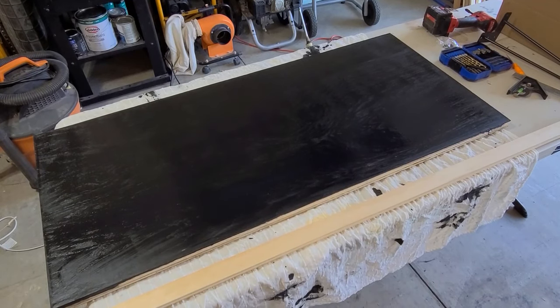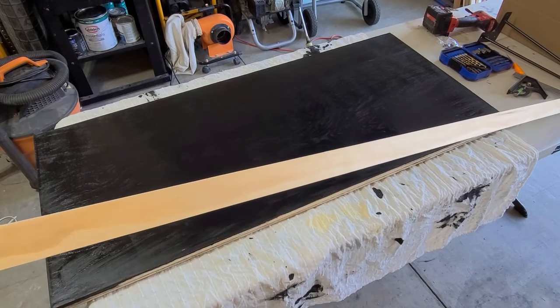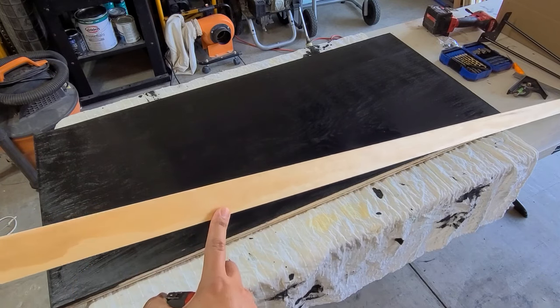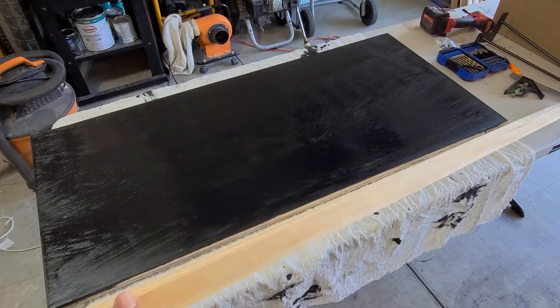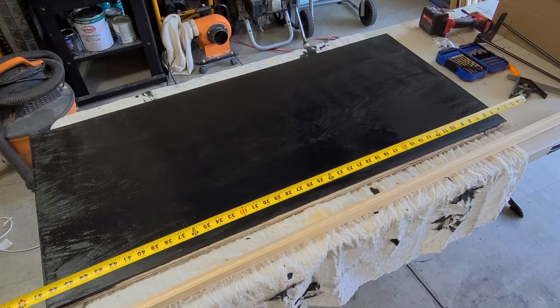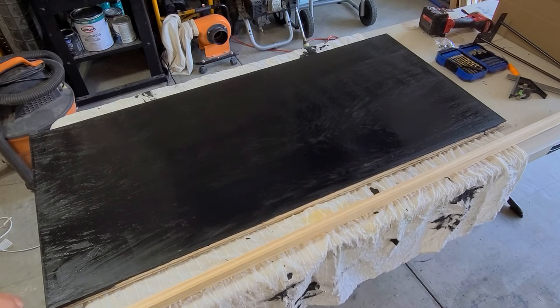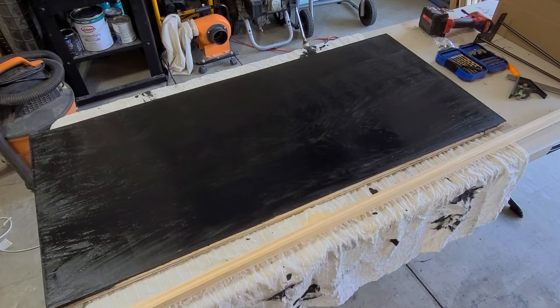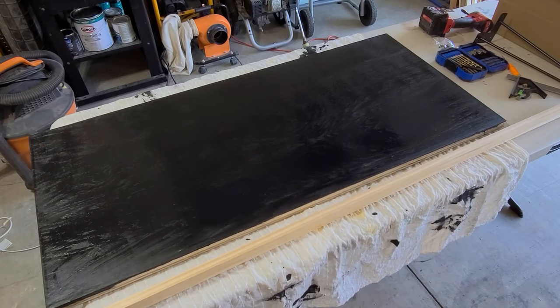While the bottom's drying, I have three pieces of six foot long by two inches by one inch select pine — really it measures inch and a half by three quarter inches by six foot long. This is going to be my trim piece. I already know it's 48 inches long from the length. I'm going to have it extend three quarters of an inch on each side, so 48 inches plus an inch and a half accounts for three quarters of an inch on each side — 49 and a half inches is what I'm going to cut two of these down to. Then I'll sand them down, stain them, put some glue on the inside, shoot them in with the brad nailer, and take my measurements for the end trim pieces and do the exact same thing.